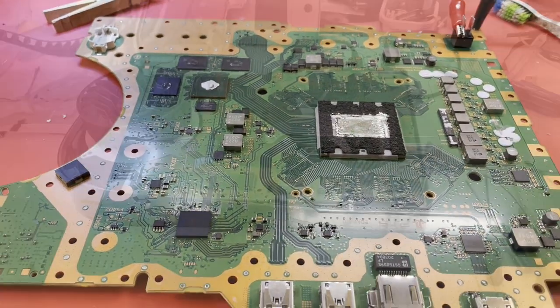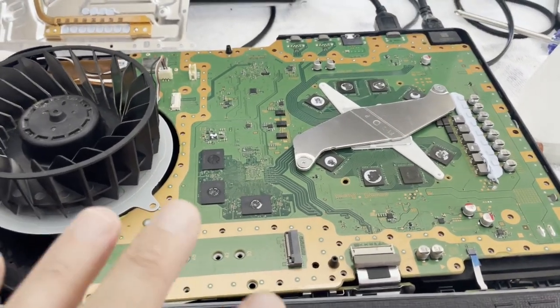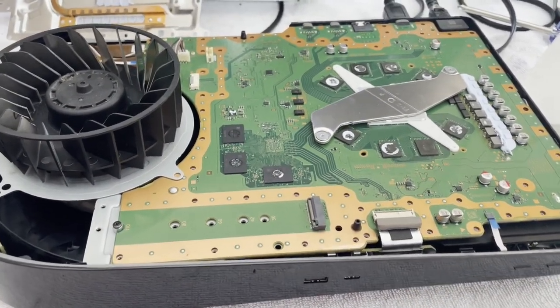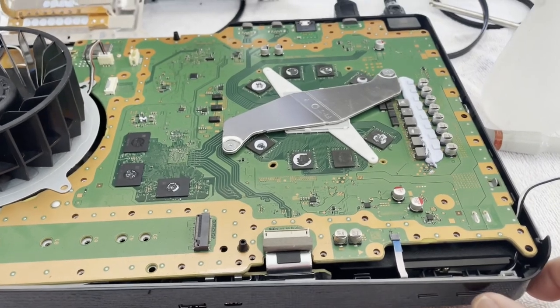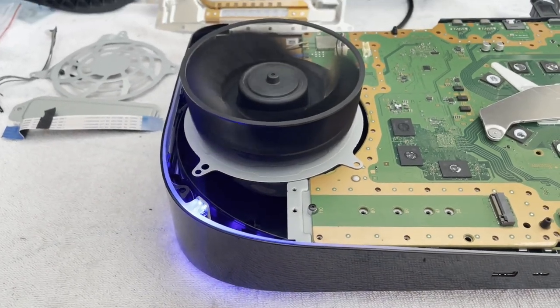It's about time. Well, here we are back out in the garage. Our south bridge has been changed, and the current draw looks to be somewhat normal, so I think the south bridge is at least initializing the system. So I think she's going to do something more than she did before now. Fans connected. Let's just see. That looks encouraging. Oh, I saw the monitor lock. Come on.